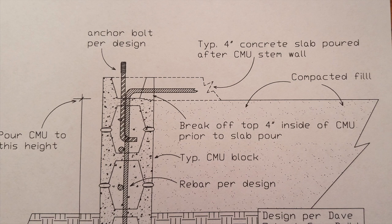And so here you see a little bit more of that. Remember, after you pour your concrete block full up to about 4 inches from the top, let that set up a few days, then you can go back and put some fill in up to your slab height.